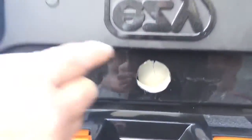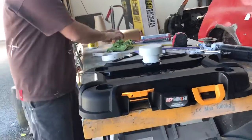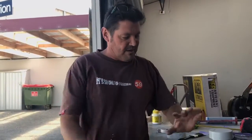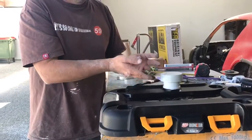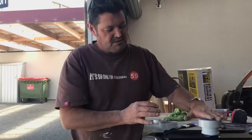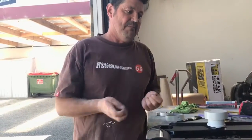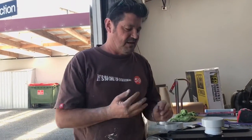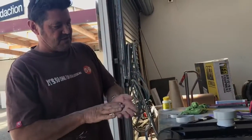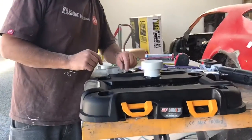That's what it looks like from the underneath side. Nice little hole in there. So I think that should be pretty good, I reckon. Yeah, waves come up, slosh there, they'll hit that, they'll just drain down, but the air won't be able to pass up underneath because there's quite a gap between the outer circumference of the little shield at the top. It won't get sucked in. It's not sucking massive amounts of air. It's got a reasonable volume, but it doesn't have a really high suction like a majorly big compressor. So yeah, that should do the job.